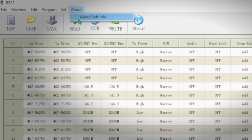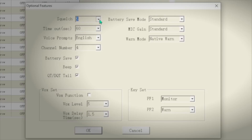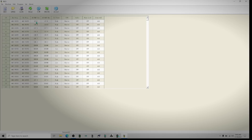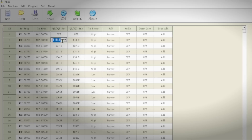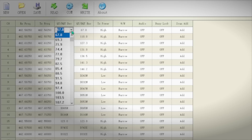When you load up the software, you will see that it is pretty much written in the same Chinglish as the user manual. The software has options for the squelch, battery save settings, and programming the side buttons, just as you would expect. Now, the reason we're here is because I currently cannot use this radio to talk to any other GMRS radios because it is polluted with CTCSS and DCS codes on every single channel. You have to go through and remove those codes on every channel. It is tedious and a pain, but it only takes a few minutes. Once you do it and save the changes back to the radio, you'll never have to do it again.